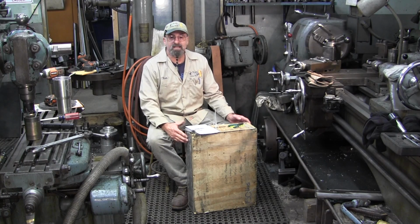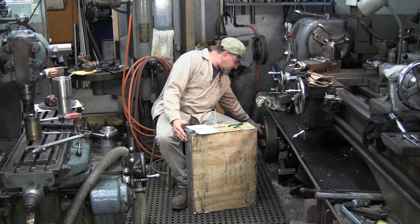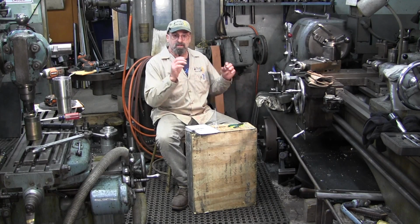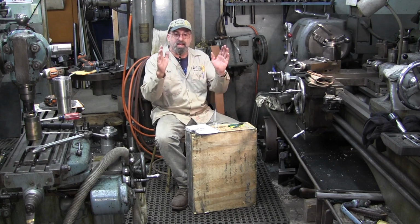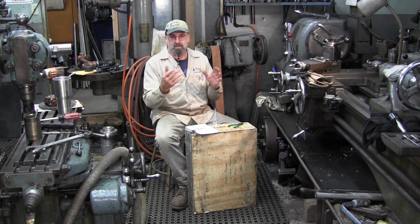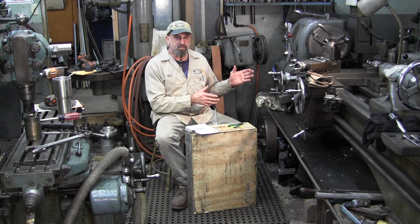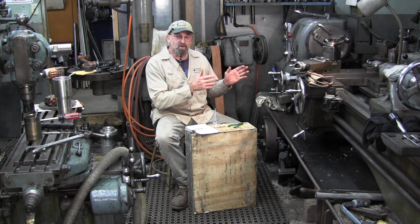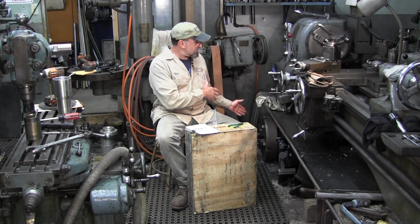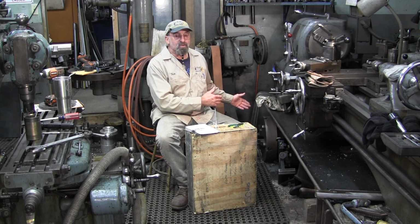The reason he did that is because he knows that I hardly use this 4-jaw chuck that I have down here, because the jaws themselves aren't the right jaws for the ways of the chuck itself. So they bell mouth out like this. You've got skill in 4-jaw dialing in as it is, but you handicap yourself right off the bat, because when you go to tighten down something, it's going to shift the face out. When you're dialing something in 4-jaw, you're dialing peripheral, but you're trying to hold face as well. With a chuck like that, you end up fighting yourself, and it becomes aggravating. That's why you don't really see me use this 4-jaw.